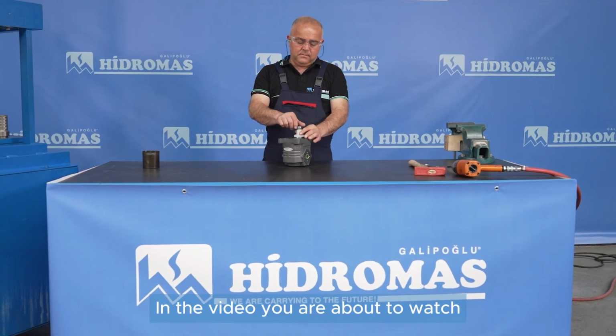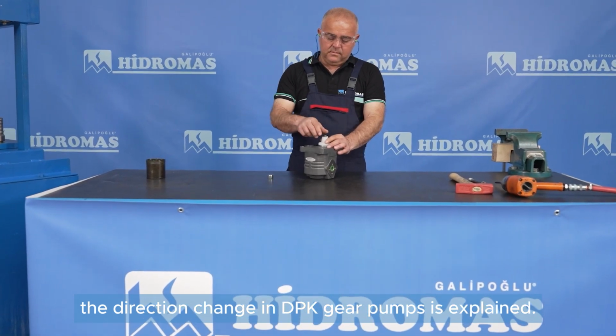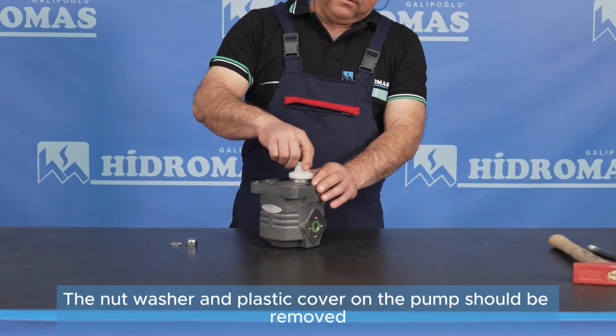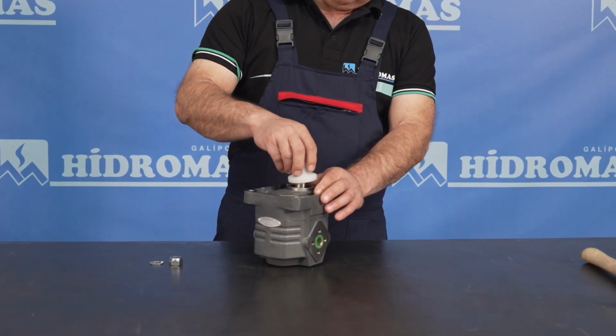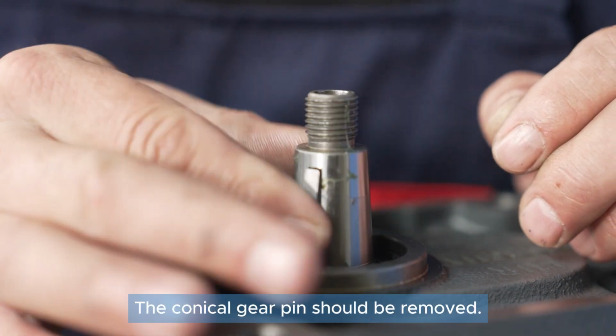In the video you are about to watch, the direction change in DPK gear pumps is explained. The nut, washer, and plastic cover on the pump should be removed. The conical gear pin should be removed.